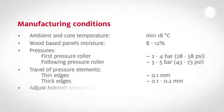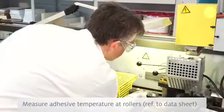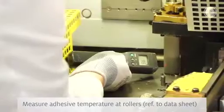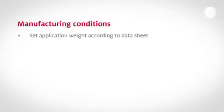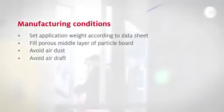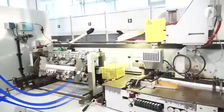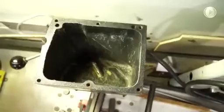The application temperature of the hot melt should be adjusted correctly. The temperature measured on the rollers should match the recommendation in the datasheet. The application weight should be set right, and the porous middle layer of particle board has to be filled. Avoid dust and air draft near the hot melt application system, as this might lead to cooling and consequently to poor adhesion. The hot melt application pot needs to be cleaned regularly.